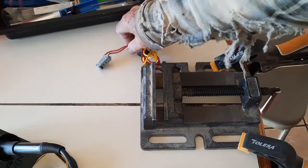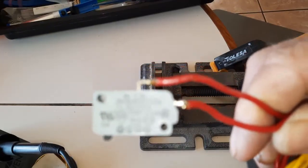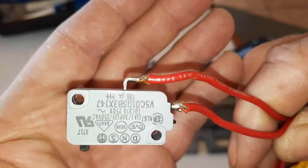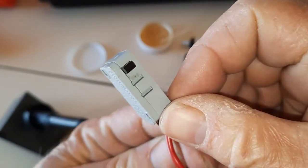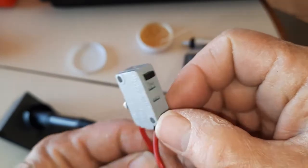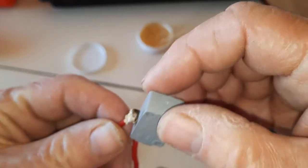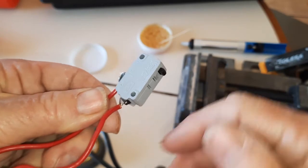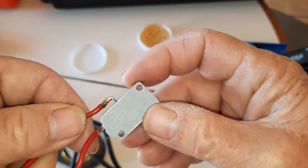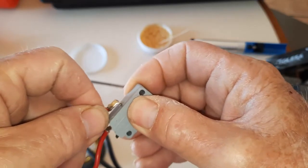Today is November 3rd, 2021. I had trouble with my heating system and it turned out this micro switch was my problem. The other weird thing is on this side you can see those little notches — I noticed when I was moving this wire that that post moved, and that post is pretty black. The other post down there that's not used is also pretty black. I'm wondering if I can take it apart because I can feel it moving slightly.